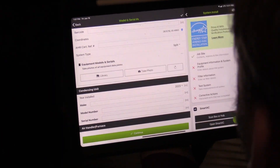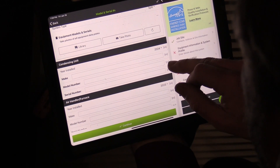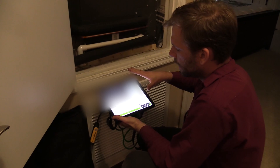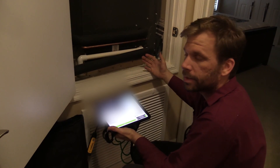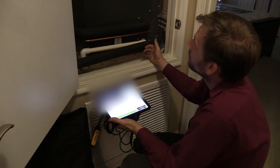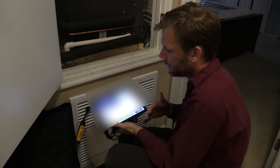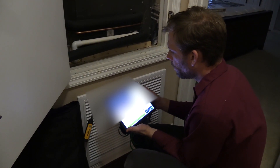System information — this is crucial. Year installed: 2024. Let's go air handler. Once I've started my project, I'm going to fill out all the information I need: the address, and most importantly the equipment size, what type it is. It's going to ask me the type of compressor, the tonnage, model, serial, all that information, and it's going to ask me about the filter. I'm going to fill out my whole system profile in here, job site information, before I start doing all the testing.